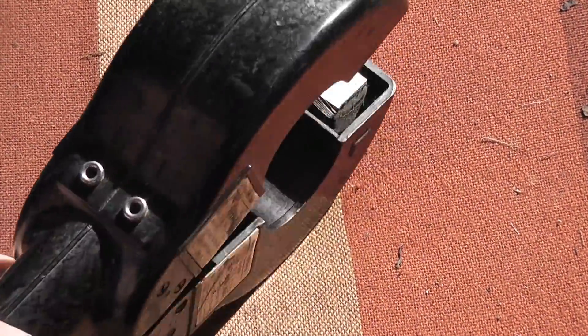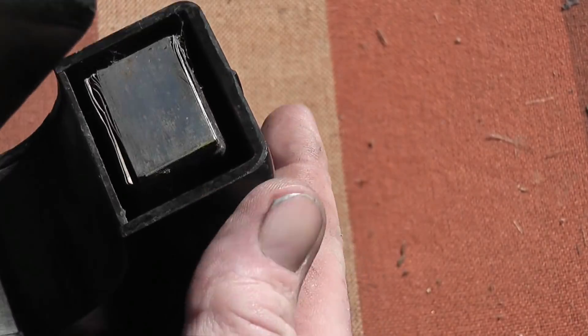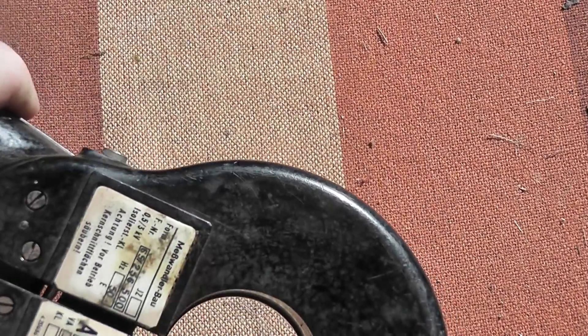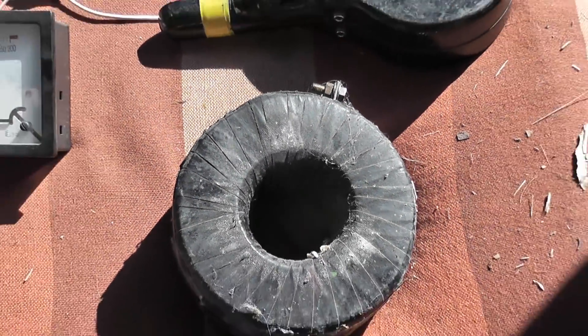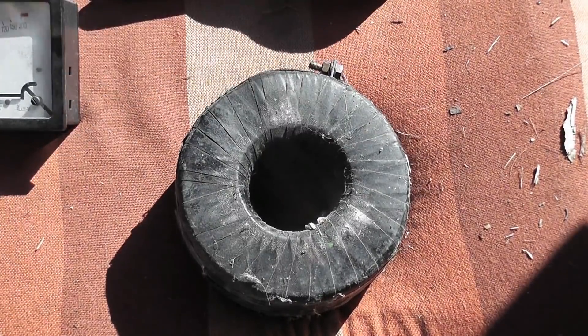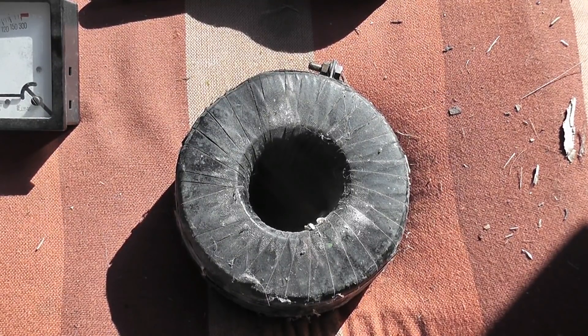It's a well-made device. The core has a shutter plate on there but you can see the laminations have been damaged a little bit. It's basically two half-sections in C shapes which make a closed loop when the device is closed. The accuracy class is probably between 3 and 5 percent — it's a clamp-on current transformer. I remember doing load survey measurements at the Vitamata power board in the mid-90s. We used these clamp CTs for temporary survey meters around transformer cables, connected to kilowatt-hour maximum demand meters or early data loggers.